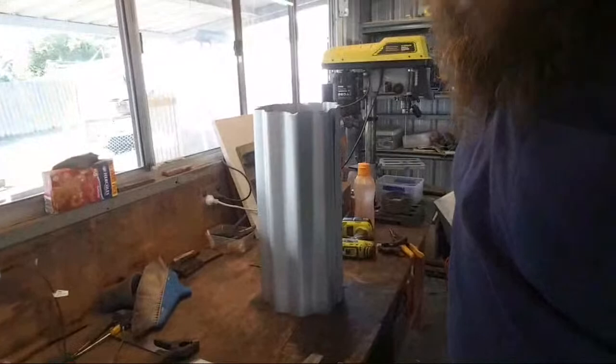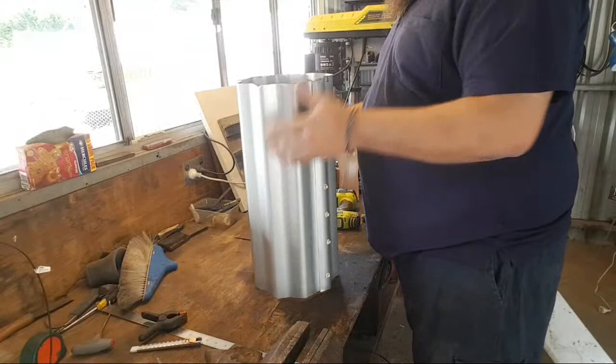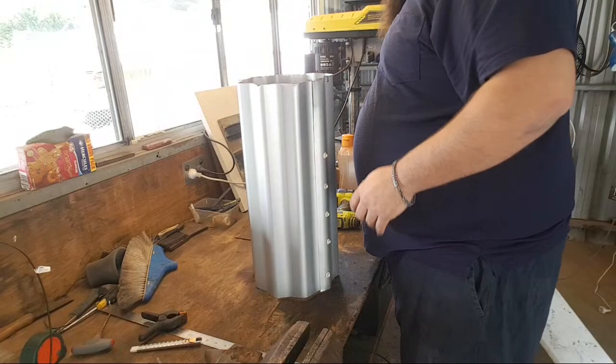Cool, so yeah, they're commonly known as postbox forges or Dom Fogg style forges. This one's going to be a relatively small bodied one. As we can see, that's about the size of the body. But it's going to have 2 inches of refractory in it, so the actual forge area is going to be quite narrow.